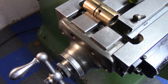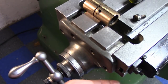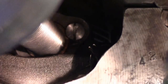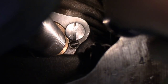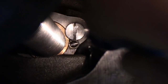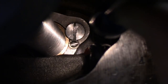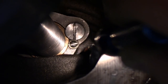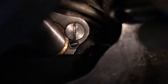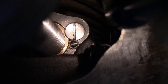The easier nut to adjust is on the table — the X axis — because you can get to it from underneath. On the underside of the left side of the table you'll see a big flathead screw and a small flathead screw. The big flathead is your adjustment screw — the tighter you make it, the more the nut flexes and engages on the acme screw. The smaller flathead below it is your lockdown screw — once you get to the tightness you want, tighten that smaller screw to lock it down. I'm setting the table in the middle of its travel.